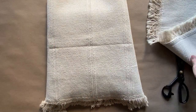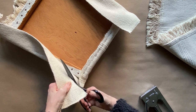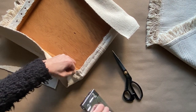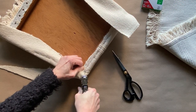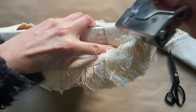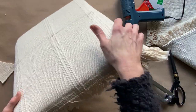I thought it might be nice to keep the fringe, so I'll use it for the front of the seat. I like to keep the staples nice and close together, which will help it not bunch up or cause a ripple. Because we're using a throw mat, it is very thick, so I did find it helpful to use the longer staples in the staple gun. I treat the folds at the corners kind of like you're wrapping a Christmas gift — just pull it nice and tight and make sure your staples are closely put together.